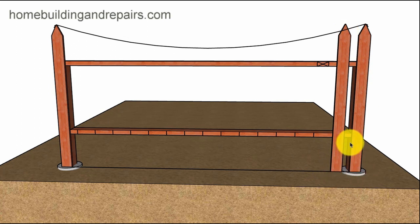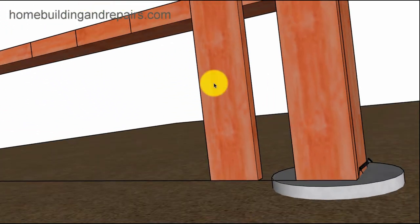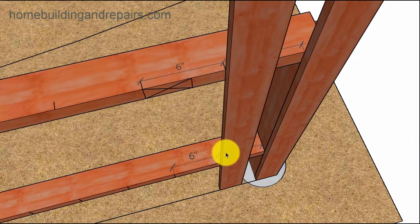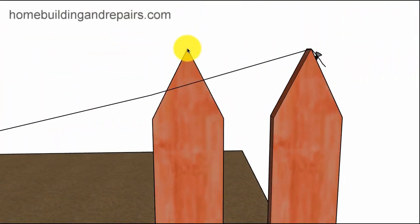In order to figure out the height of the board, we're going to line it up with the bottom string — set it right where it goes and line it up with the bottom. Then we make sure everything is where it needs to be. I don't recommend putting any temporary screws in here because you're going to be putting holes in your fence — this board is actually going to lower. You'll have to hold them in place and make sure the spacing is the correct dimension.